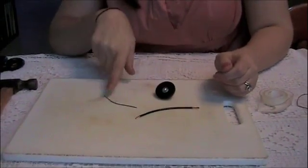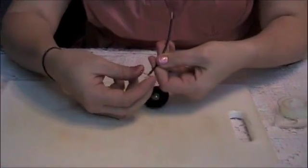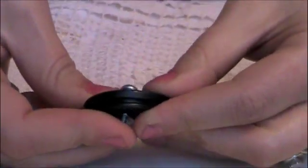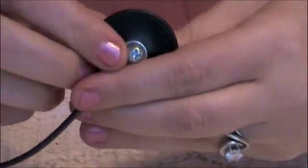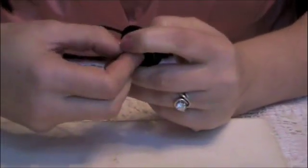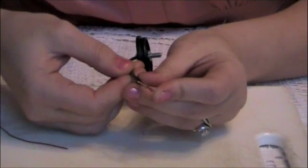Take the cap that you've already assembled, the short conducting wire, and the short braided insulated wire. The end that's longest, you're going to want to spread out the strands a little bit because that's going to get affixed to your cap. Remember how we kept the nut loose? Push it up so that you've got a gap between the top of your bolt and the washer — that's going to allow you to wrap the edges of the braided wire around it. Then pull the bolt back down and tighten the nut to keep your braided wire attached. The other end of the wire is going to get spread out in a fan shape — this is going to be our collecting strand.